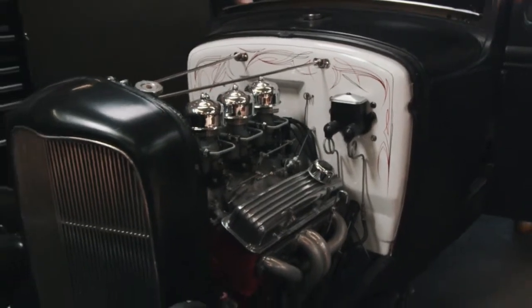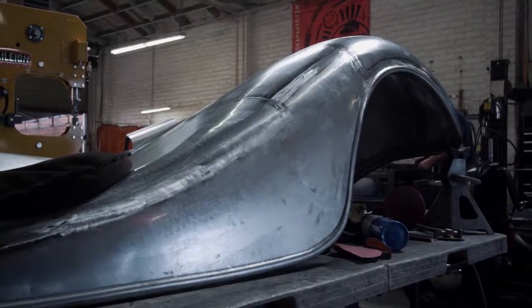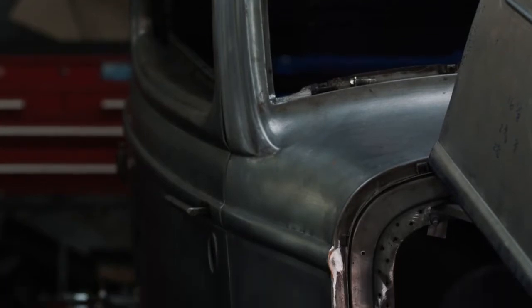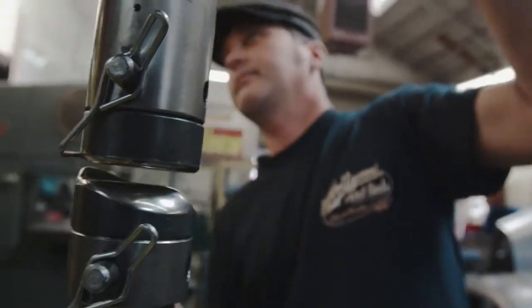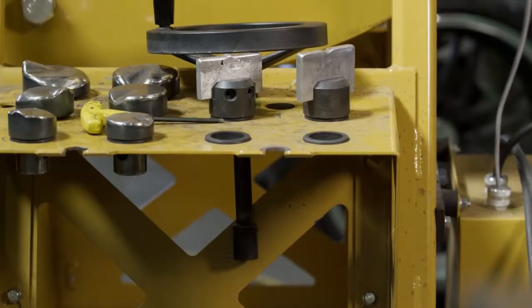Building an entire car in an art deco style — compound curves, extreme radii, and extreme shapes out of metal — we got to the point of bypassing what we could do with just normal tools and needing a power hammer. That's when we ended up stepping up to the Bailey machine. One of the things that's really valuable on a lot of these projects is the pull max, and the Bailey machine also operates in a pull max mode.